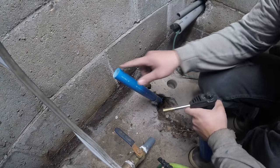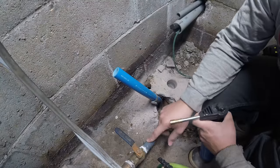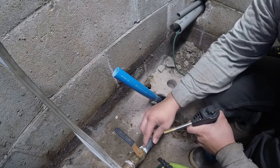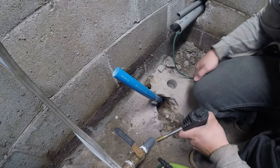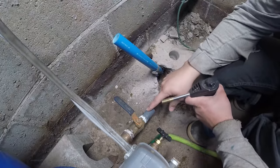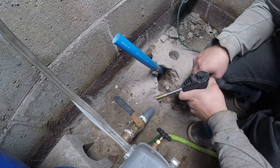We're going to start warming up this tube real carefully and the heat is going to be our best friend. One other thing I want to mention is that this adapter right here is a one inch barb by three quarter inch male threads going to this valve here. Normally I would rather have a brass barb fitting, but I don't have one available at the moment. If you're choosing a barb fitting at the hardware store, I would highly recommend going with brass.